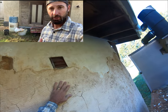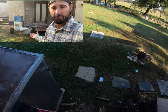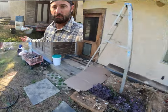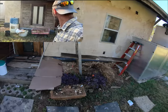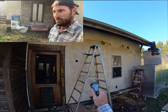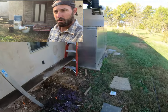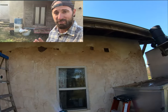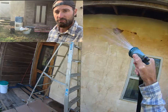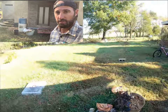If you don't have a very high budget, I would recommend using this hydrated lime. It's sustainable, an adequate solution to make lime putty, to add to sand to make plaster. If you do have a pretty good budget, or if you're building for someone else and you don't want to have to deal so much with callbacks, or if you just want a product that will last 50 years, hydraulic lime is a good way to go. You just better make sure that you've got that money for your budget.